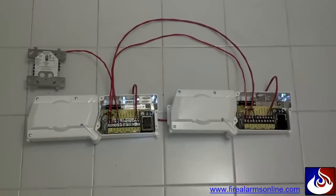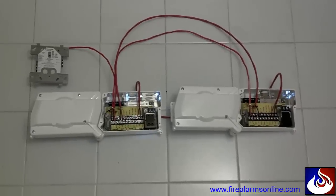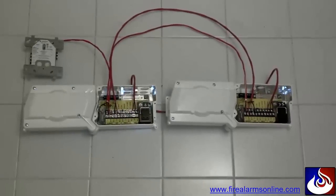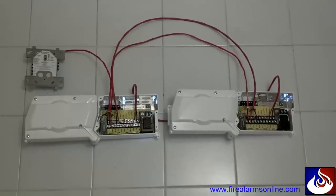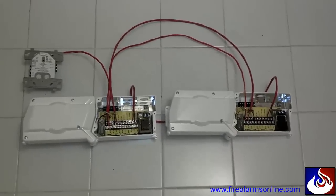In this video I'm going to show you how to connect multiple 4-wire conventional duct smoke detectors off of one addressable monitor module. In this demonstration I'll be using the System Sensor D4120. And if you're wondering why it's white, this is actually the D4120W, which is used for weatherproof or outdoor applications.